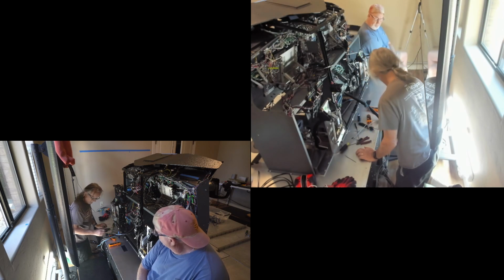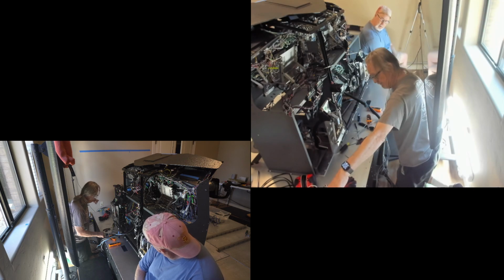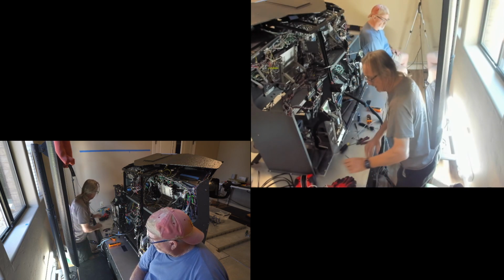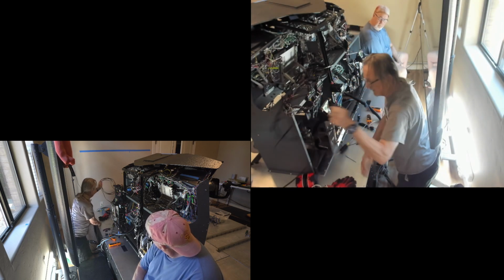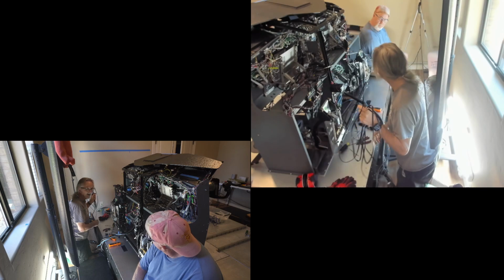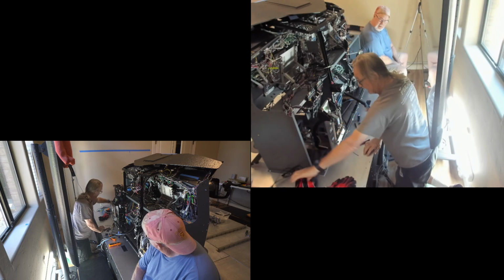On that wall is the port for the network, and we're going to run it back along this wall, which was another problem we had. We got everything working, and then it still wouldn't work. Come to find out, this nice Cat 7 cable, which hasn't been used much, would only let us get 100 meg through. So I cut the end off of it. We've got to fix that one. Another problem.